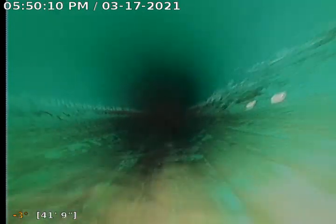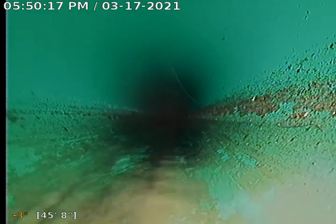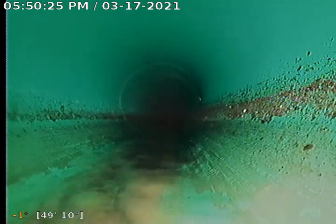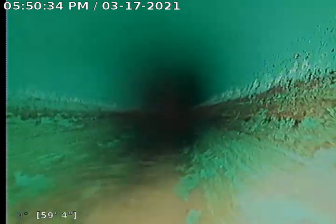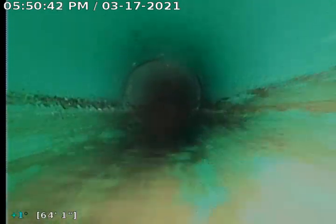So there's about 30 feet of cast iron pipe under the slab that, again, is going to need some attention at some point. We'd recommend having a sewer scope performed every year or so, keeping an eye on that. And like I said, you've got to go into this knowing that at some point that's going to need some attention. So this will be along the fence line in the backyard, along the west neighboring fence line.